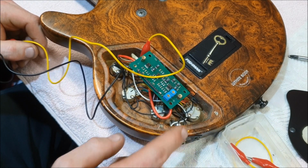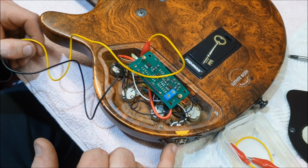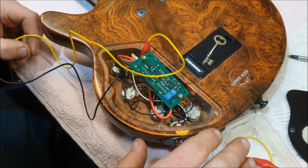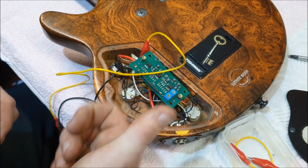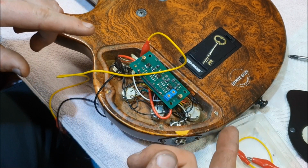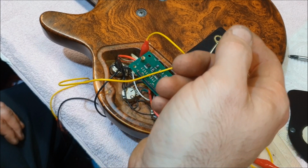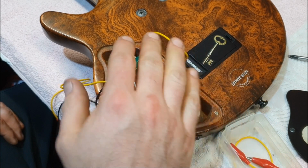People who know the Cort Turbo bass will know that this is not the standard output jack. I had retrofitted an XLR plug in here so I could have a DI out directly out of the bass. I went to do an acoustic gig in Wanaka, 10 years ago. And the sound guy said to me, "Oh, you just plug your bass directly into the desk? Fine, no problem, excellent, nice and easy, no amp required." Put me through the foldback speakers, and it was great. Except that this is designed to run on 9 volts, and I had plugged directly into the mic signal of the desk, and he had put the phantom power on and sent 48 volts shooting straight up into my preamp and killed it dead, fried the whole thing.